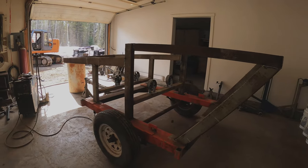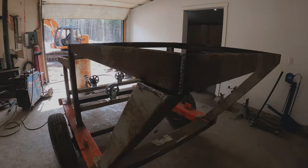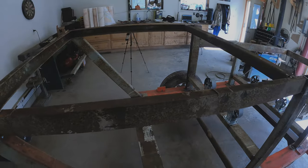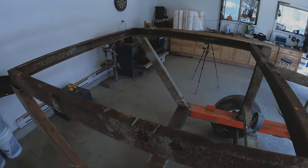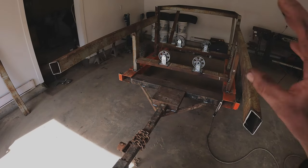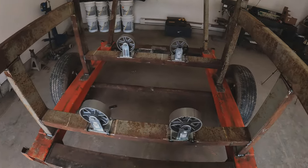There's our main frame — it's about 50% welded together. It'll have a fairly large hopper for a small trommel: four feet by four feet. That'll give plenty of room for a mini excavator to feed it. This back bar will stay off for now so I can work on the barrel. The rollers are already mounted and lined up, just tacked into place until we get the final fitment of the barrel.